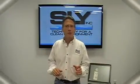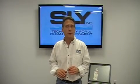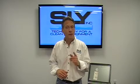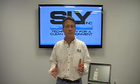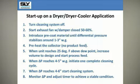Now if your baghouse is installed on a dryer or dryer cooler application, you'll need to start up a little bit differently. The first 3 steps are the same, but then you'll need to preheat the collector to avoid a moisture issue. The startup process for this is, again, turn off the cleaning system. Start the fan with the damper close to 50 to 60% of design volume. Inject the proper amount of pre-coat material at the required feed rate as discussed earlier. Now maintain this flow until the baghouse stabilizes, again in a range from 1 to 3 inches.